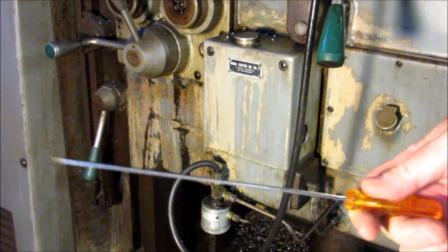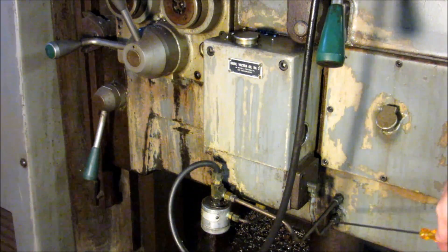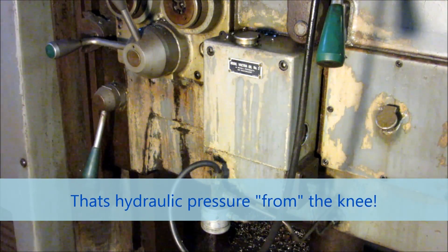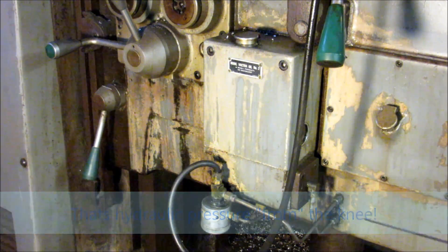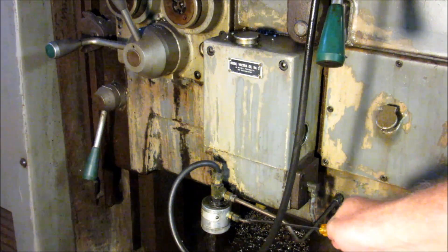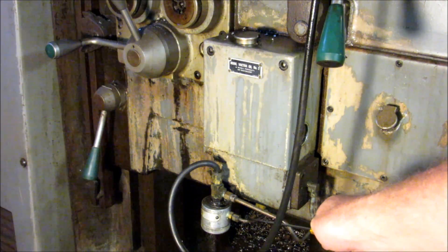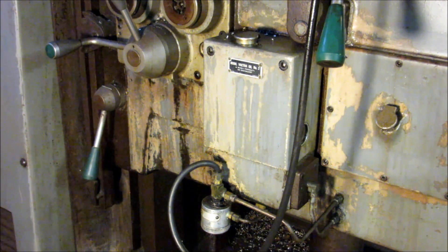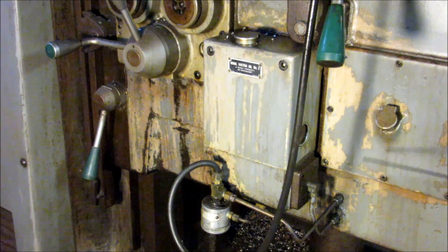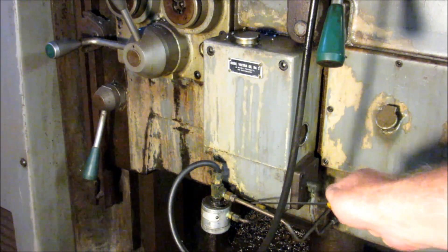Can you see my little flashlight? My little pointer here is a screwdriver. The way this works is this bottom hose here is providing hydraulic pressure to the knee. It pushes against pretty significant spring pressure inside the knee — there's a spring in there — and the hydraulic pressure pushes against that spring, moves a piston through this area here. And it outputs through a check valve on the bottom here through this little hose into this — this is actually a little filter. There's supposed to be a little wire filter element in there. I don't think either of these actually had anything in them when I got them.